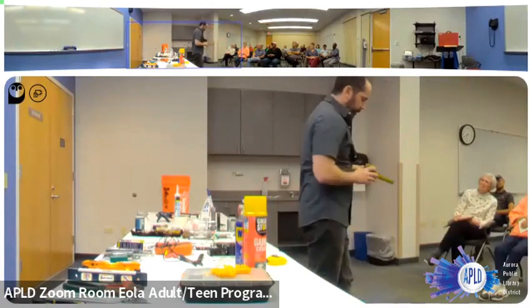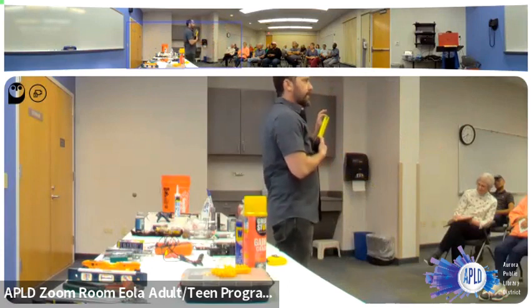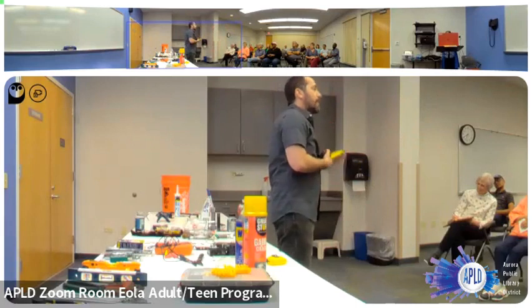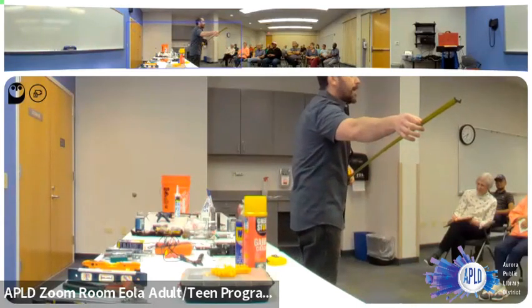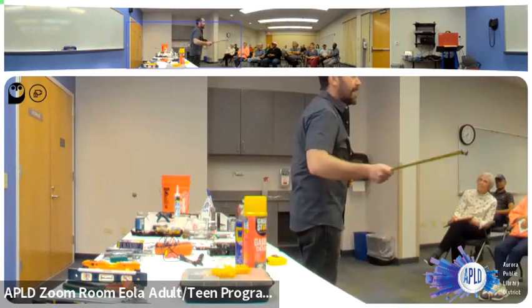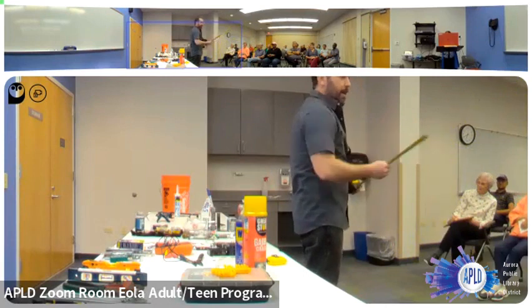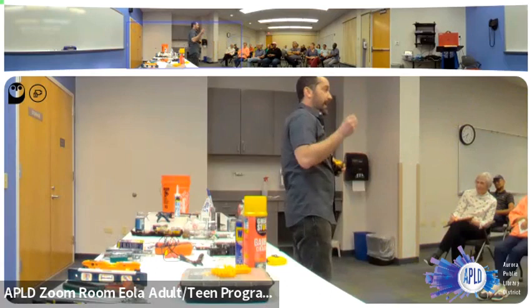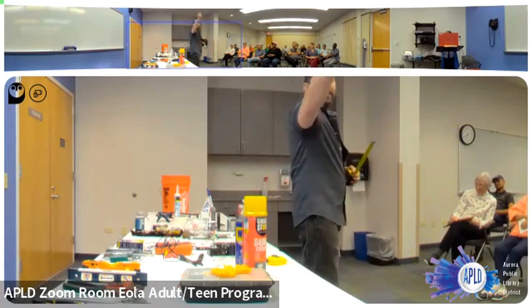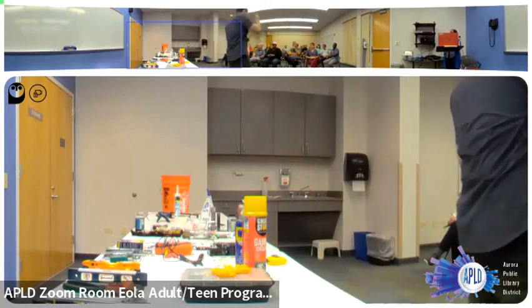All right, more importantly, tape measures nowadays are coming with little magnets on the end. Little magnets on the end are great if you are measuring to an iron object, but they are a real pain in the butt if you are measuring next to an iron object. Something to think about, all right? A lot of those magnets now come off because they know that there's a possibility. I've never found one that I put back on in my whole life. I've taken them off and then they're gone. They fly.